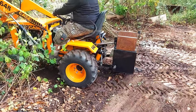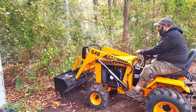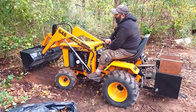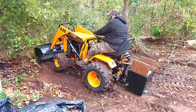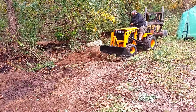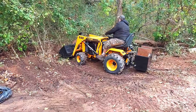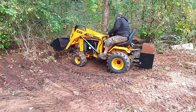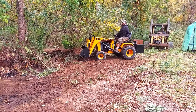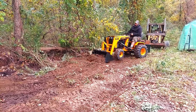The wide tires and wide axles make stability much nicer, especially with the fork machine. These tires are awesome - they're OTR, I think called lawn tracks or something like that. They're the best tires I've found for this setup. Traction in reverse is not nearly as good as forward, but still very good - far better than the stock tires that came on these wide flotation kits. The original 15-inch ag tires left a bit to be desired, and the R4 skid steer tires have horrible traction - they're too hard and not made to bite deep. They're great on concrete, asphalt, or hard pack, but in dirt, mud, or anything soft they don't do well.